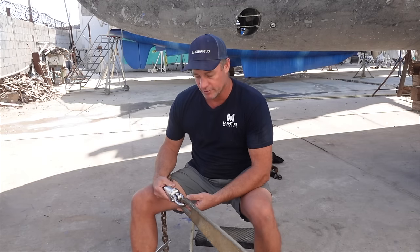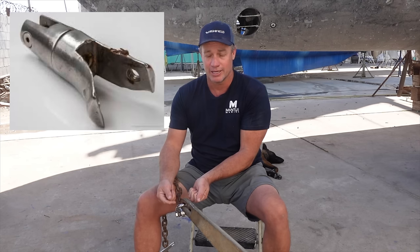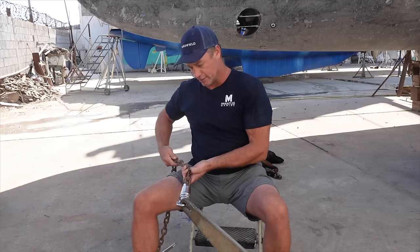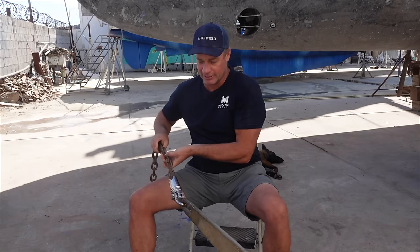Our original swivel wasn't like this. I had pretty much bent the arms holding the pin together, the pin came loose, and as we lifted the anchor up I could have pulled the pin out — we were this close to losing our anchor. I scrapped the idea of a swivel and went to a shackle. But the problem with just a shackle is that if you spend extended time at an anchorage with tides and wind shifting, your chain builds up a lot of twist. A swivel keeps turning so you don't end up with chain twist.